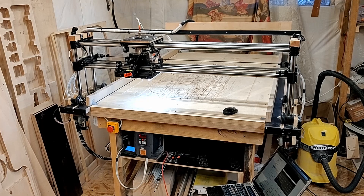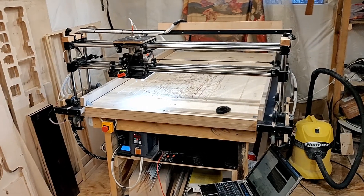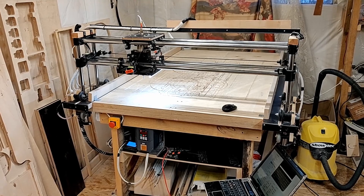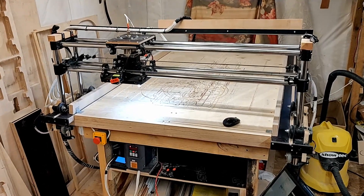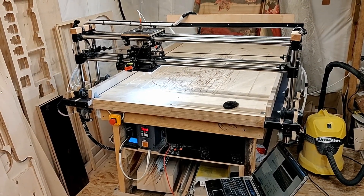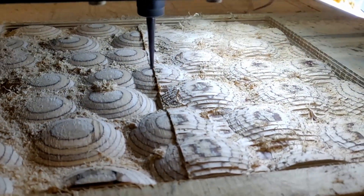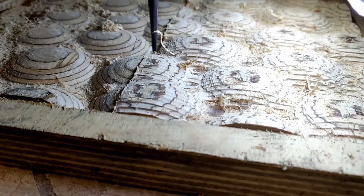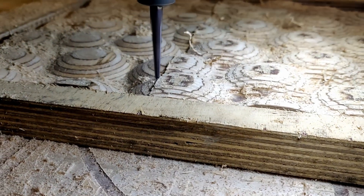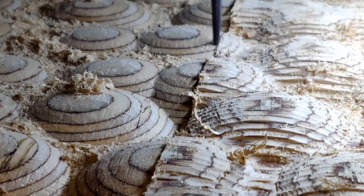One issue I still have is that the machine is still quite wobbly — the table itself tends to move from side to side and the tubes are a little bit springy. This becomes an issue when machining 2.5D shapes and figures, as on a small scale the machine still vibrates, oscillates, and resonates in all kinds of directions. For small, very tight detailed work, this can become a problem.